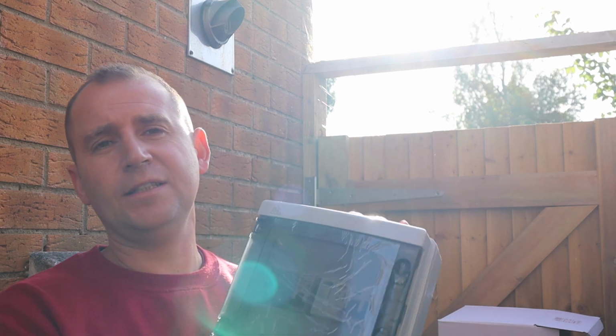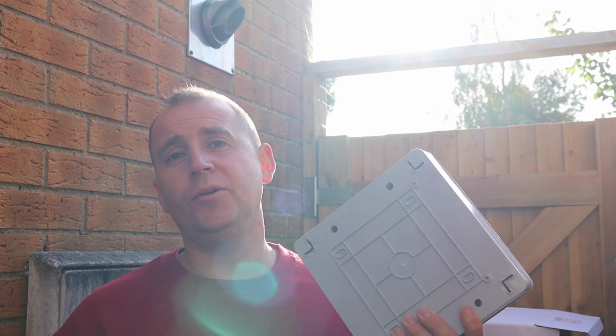Okay, the consumer unit I'm installing today is this 8-way IP65 rated consumer unit by Whitecliff Electrical. I've done a video including this last week. I'll leave a link below in the description if you want to check it out. It's a really good consumer unit. It's a bit bigger, but as I said before in the previous video, it allows for spare capacity for the future. The other thing about this consumer unit is the more room you got, the easier it is to dress your cables in. Some of those other smaller IP consumer units, they're just really tight, so why not just give yourself a little bit more room.